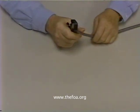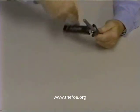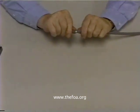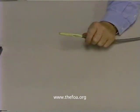After we do that, go back about three to four inches on the cable and run the jacket cutter three or four times around, and then just simply snap the jacket and it should snap right off.